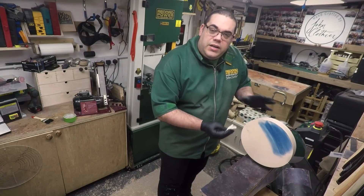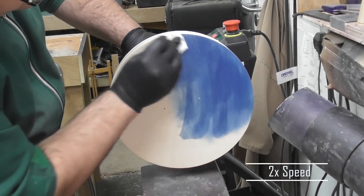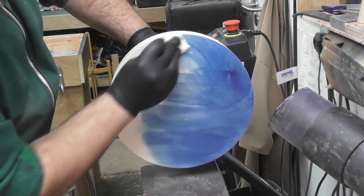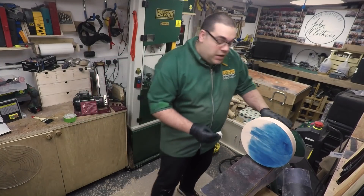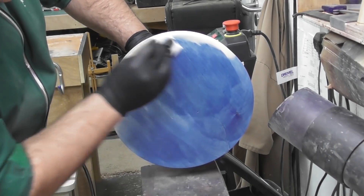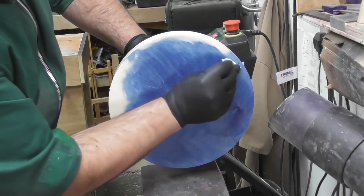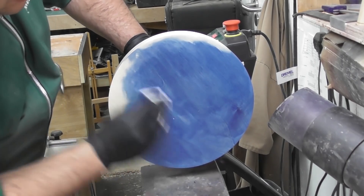When the tissue stops applying colour and it starts to get a bit hard work, just give it another squirt. There are two ways you can apply: you can either go with the grain or you can go around in circles. I like the going around in circles method because it does give you some variety and it gets the colour right in, but it does very much depend on the piece of wood. When you're using the circle method you can blend, which means you can remove any harsh lines — for example you can see there's a harsh line between the lighter blue and where it's darker. Using the edge of the tissue you can rub that in and you'll end up without any visible lines.